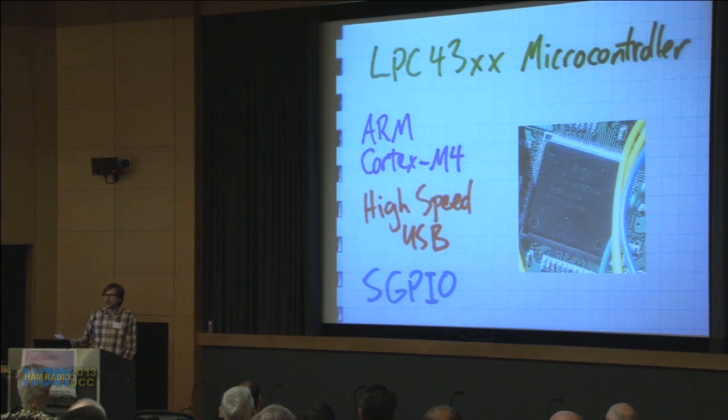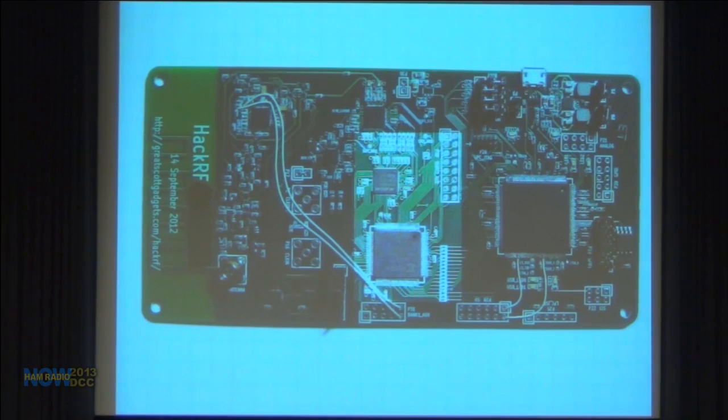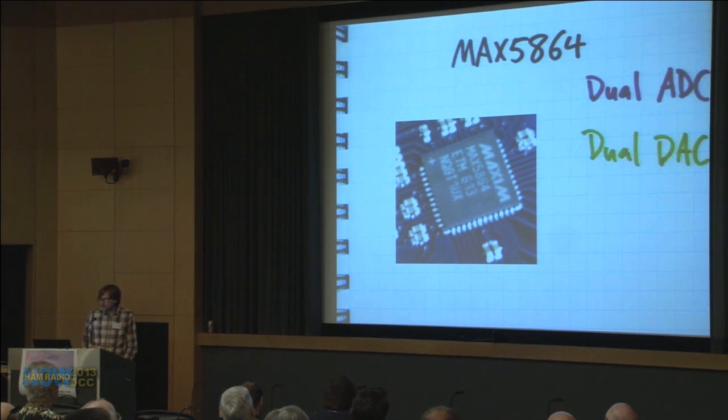This part runs at 200 MHz — no slouch, but not the amount of DSP people might be familiar with from platforms using big FPGAs. It has integrated high-speed USB and a peripheral called SGPIO — Serial GPIO — a highly configurable serial or parallel interface that we use to talk to the ADC/DAC through a CPLD. The ADC/DAC is the MAX5864 from Maxim — dual ADC and dual DAC on one chip. The only non-straightforward aspect was its DDR interface, which is why we put the CPLD there in the first place.